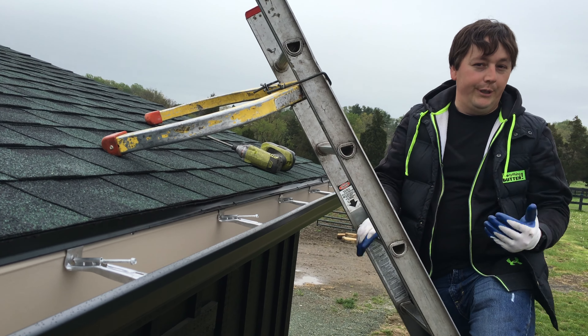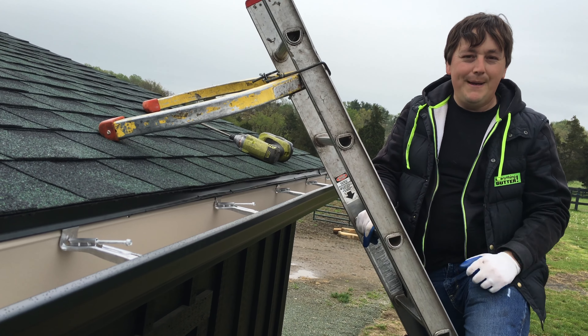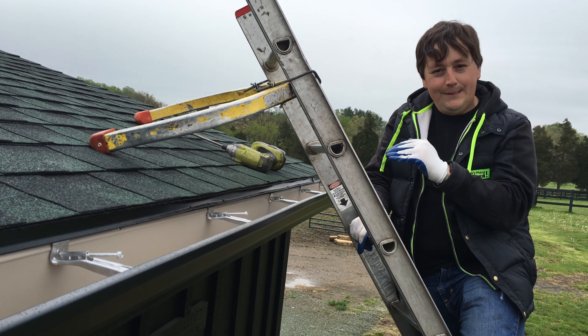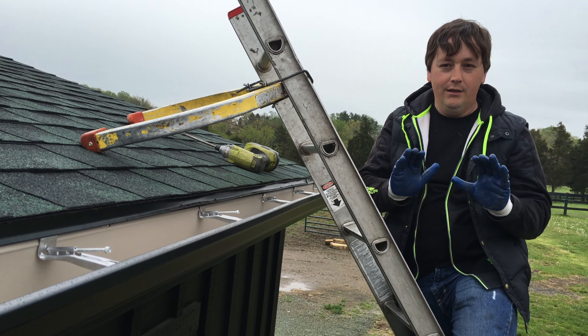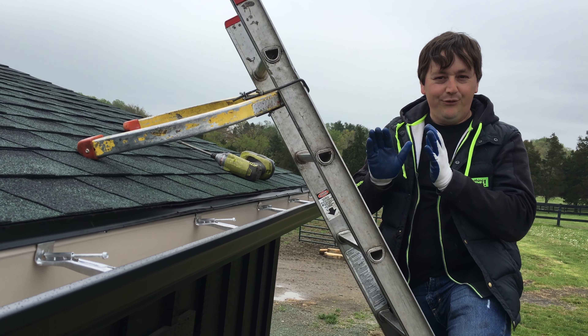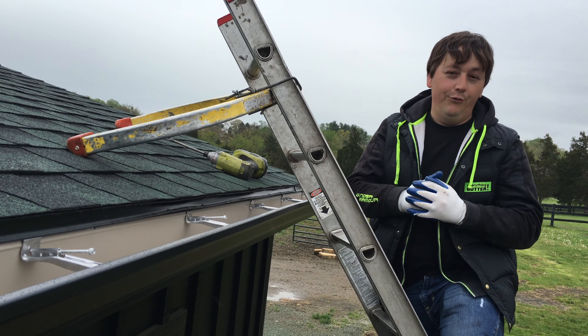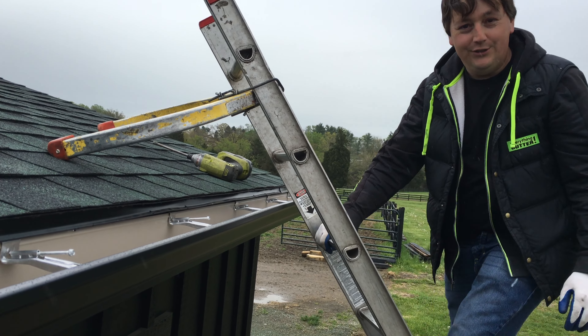So that's something to think about when you're doing a new gutter installation. You put the gutter up there and the drip edge is flat against the fascia — quickly bend that out, and that'll divert the water into the gutter. Keep in mind the purpose of the drip edge: it's there only to divert the water into the gutter, to keep it from going behind the gutter. Hopefully that has helped. Any questions, shoot a comment below. Thanks for watching. Until next time.